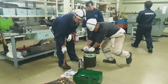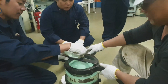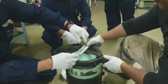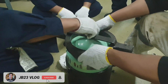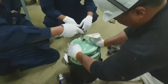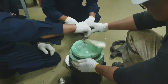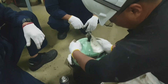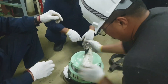That's the special tool of the accumulator — just hammer and turn until it will remove so we can detach the accumulator. This is the lifting bolt of the accumulator top cover. The membrane is from the lower part only. When we tried refilling the nitrogen gas, we could not refill the accumulator due to leakage, so our suspicion is to replace the accumulator membrane.